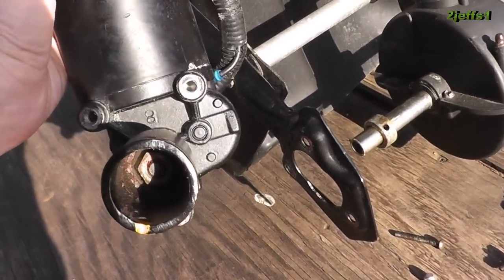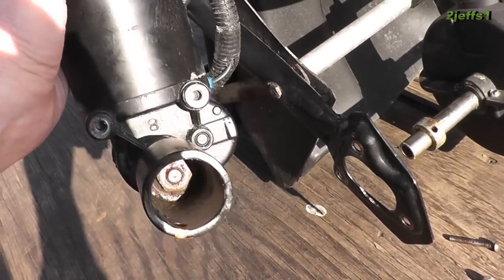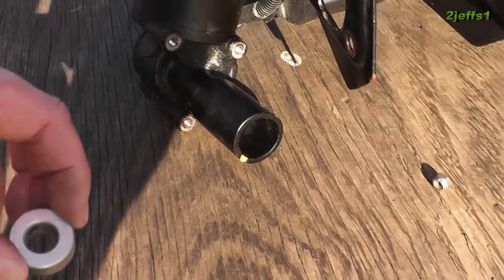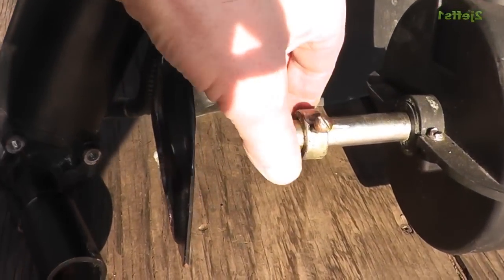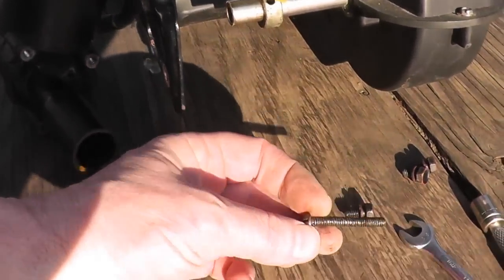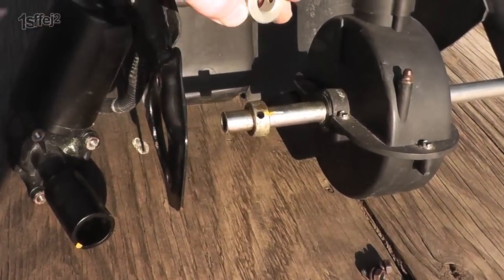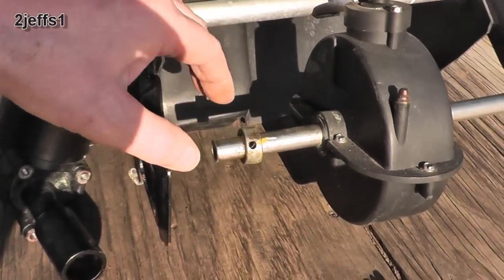For access to put it on and take it off, you have a nut inside — use a deep well socket for any kind of servicing you'd ever have to do. To accommodate the gap where the axle goes in, I have a set collar and I drilled the hole all the way through it for a bolt with a nylock nut. I had to drill the half-inch set collar out to five-eighths to accommodate it for this use.